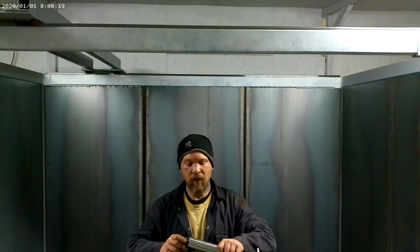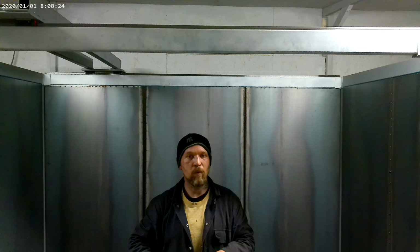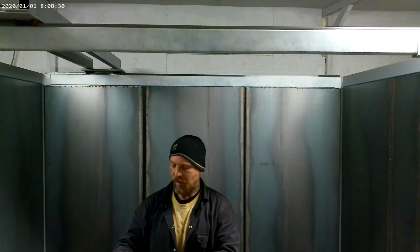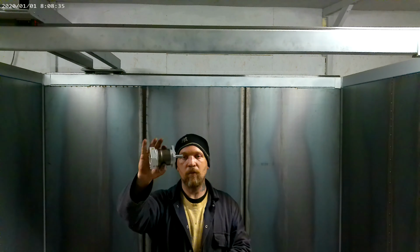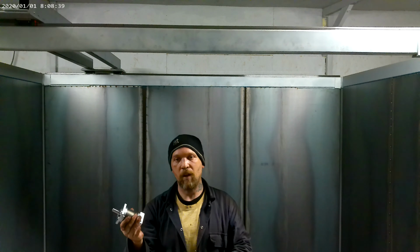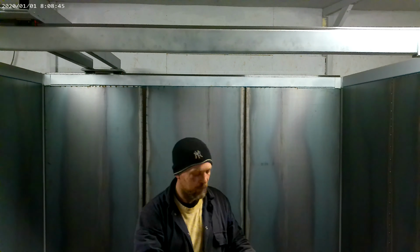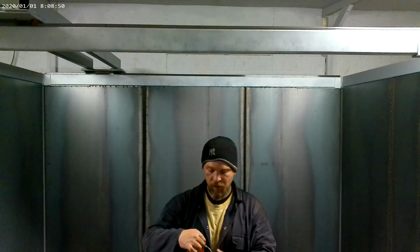It's supposed to be rated at around 2 kilograms per hour output. We'll see about that, we'll see if we can do better. I do have for it a planetary gearbox. This is 20:1, and I've got on my servos a rate of 4000 RPM, so I should be able to get plenty of torque out of that. Hopefully plenty of material out.